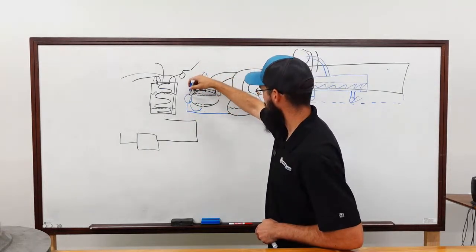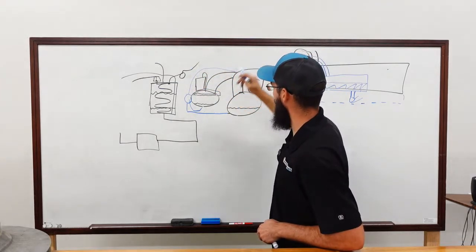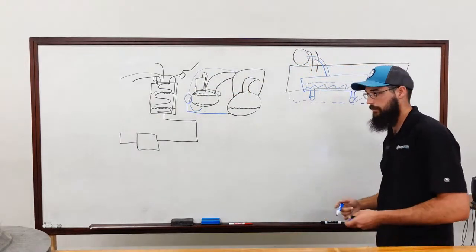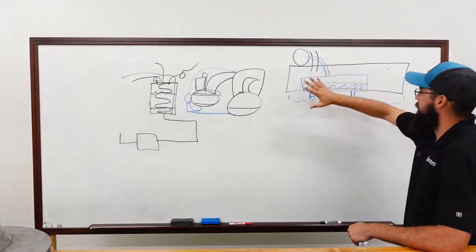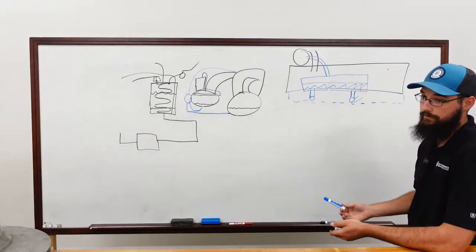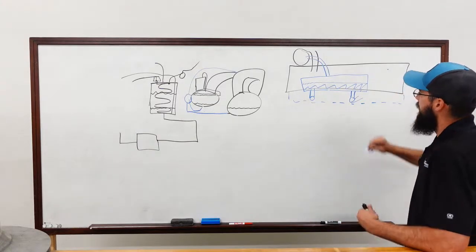And then over here, you're going to see the, not a literal representation, but the economizer line pulling back into the compressor. Again, not a literal representation. Basic Trane economizer. Now, let's say we have a CVH E series, means three stage.